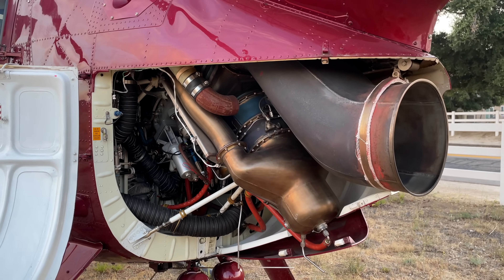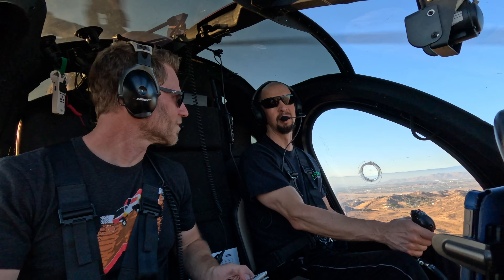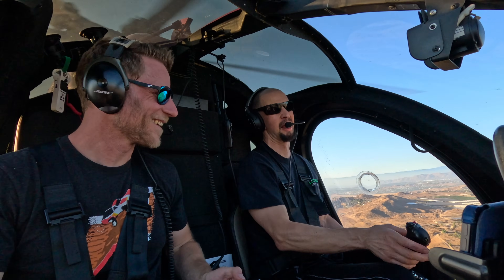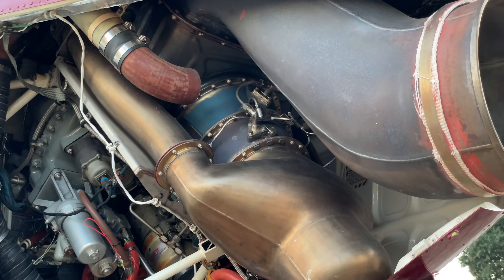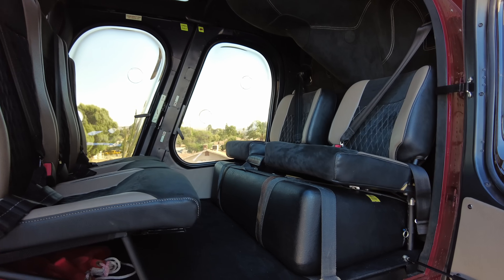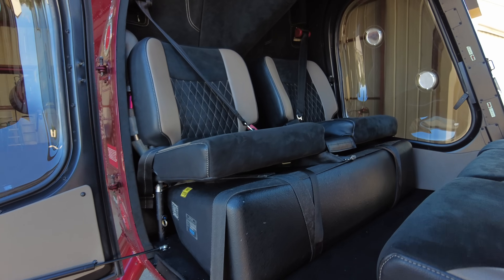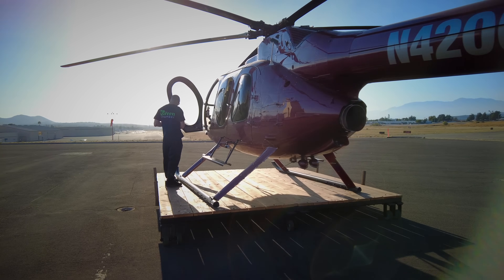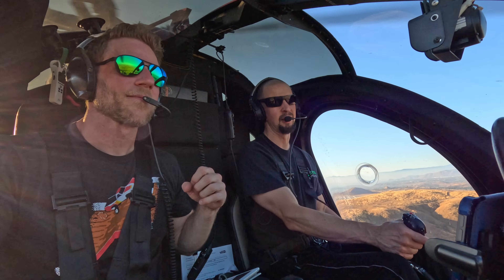It's got a Rolls-Royce 808 horsepower turbine — the 250C47M. It's got a lot of power. I've made it climb like 2,500 to 3,000 feet per minute with one person in it on a cold day in perfect weather, just pulling up and back. I know it's got a boatload of power — performance is great. You can't beat that in a light duty helicopter. With the auxiliary fuel tank, I'll safely fly this thing about 2.9 hours with a good 30-40 minute reserve. So you've got about safely three and a half hours. At 135 knots you're going to get safely about 420, maybe 450 miles on the right day.